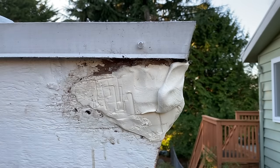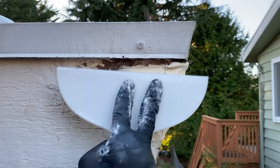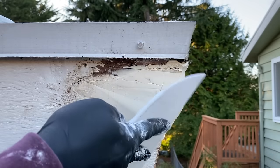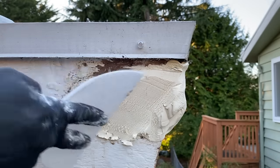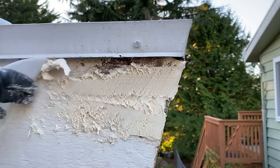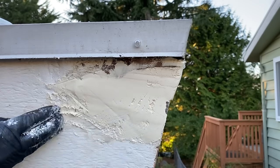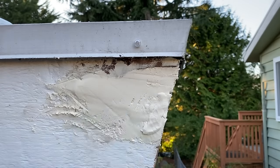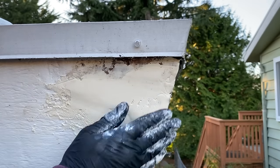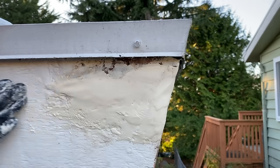Once the hole is fully filled, you can take the putty knife included with the kit and press it down. However, because my hole is so large, I grab an 8-inch putty knife and really smooth out the entire surface. One trick: in order for the product not to stick to the knife, I take a bit of WD-40, apply it to the knife first, and then smoothly spread out the wood epoxy. That way I can have a nice even coat over the entire surface, as well as reduce the sanding needed in future steps.